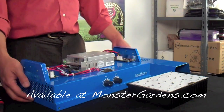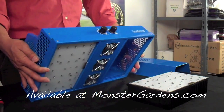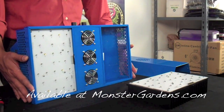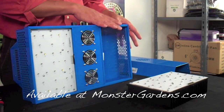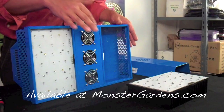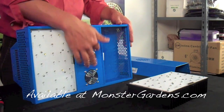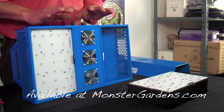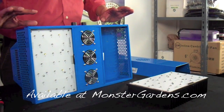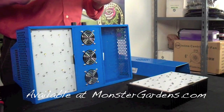If something potentially fails, there's sort of a backup. It's designed so that it'll keep running. If one of the arrays goes down, the other array will continue to run, so you're not going to lose all your light. If one of the fans goes down, the other two fans are spec'd so that they will continue to cool the array at an optimal level. Okay. So nothing's going to fail.